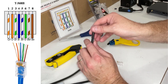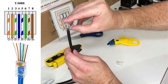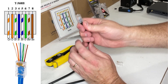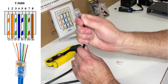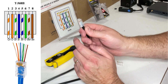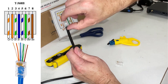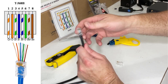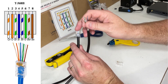The clip part is on the back side — you always want the clip on the back. That's a good rule of thumb: always have the best view possible of your wire colors, so the clip is always facing back. If you turn it around, it's hard to see what the colors are with the clip in the way. So that's exactly the same color set, and now I need to take this end of the wire and put it in exactly the same order, which follows the 568B standard.